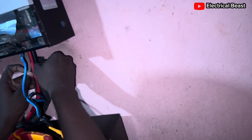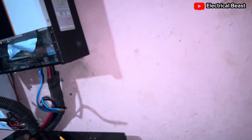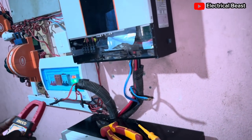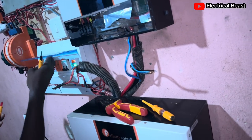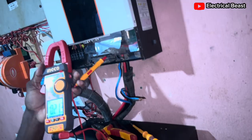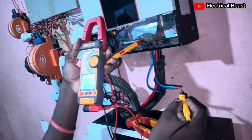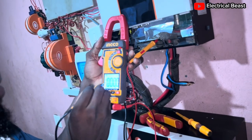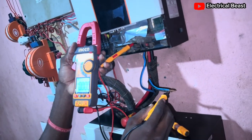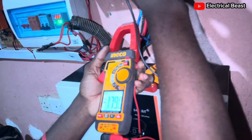Now connect negative. In fact, to be sure — I'm seeing blue and black here — let me test with the multimeter. I will turn on the breaker and let's see: this is plus, this is minus. Okay, it's correct. If it's reversed, you'll be having a minus sign on the multimeter. So if you reverse the connection — reverse the leads on the multimeter — you'll get a minus sign. If it's the reverse connection, that's wrong. This is the right connection.